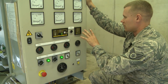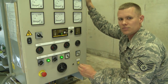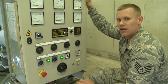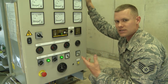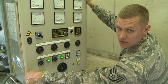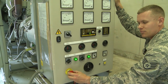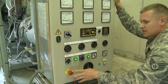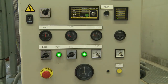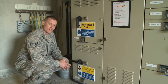In case of emergency, you need to stop the generator quickly. Usually it's an oil leak or a coolant leak — the coolant will be green, the oil should be a tan color, that's how you tell the difference. In the case of a fuel leak, you'll be able to smell the diesel and see it coming out of the tank on the bottom. Focus on this red emergency stop button — in the case of such leaks, press this button and it will stop the generator immediately.